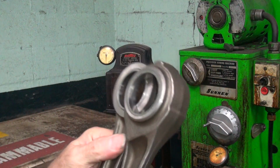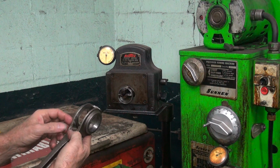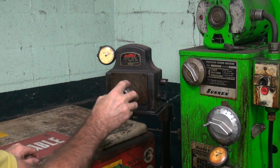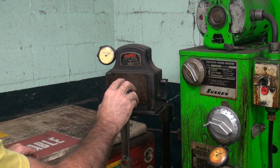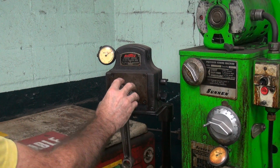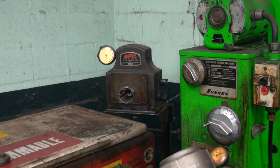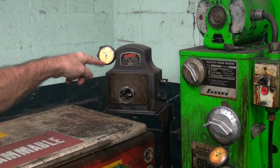Now we go ahead and measure our rods here, see how far out of round they are and what size they are. So they're 8/10 undersize, and you've got about 3/10 out of round, which isn't too bad. Hopefully you can see all that. These are pretty tight, so I can probably hone these as standard. Remember, our bearings are 4/10 under the crank pin.